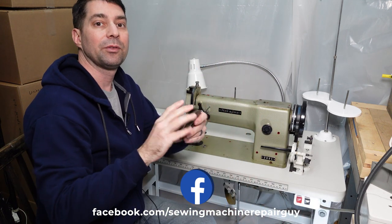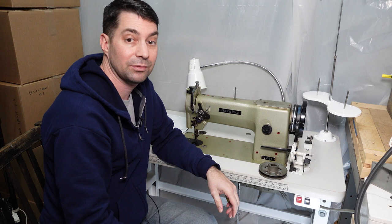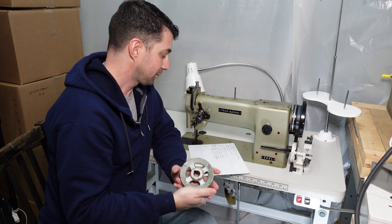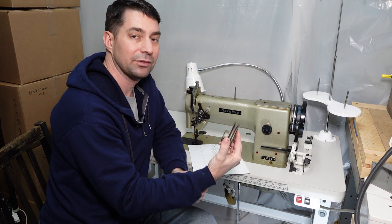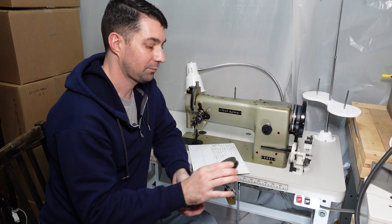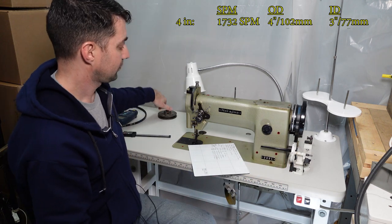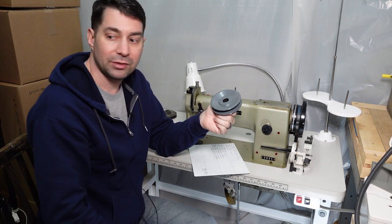Back to the first one — the original pulley that came with this machine, as far as I know. I was probably about 5 or 10 when my dad got it. Going by outer diameter gives rounder numbers — the inner diameter is odd numbers, but I'll throw it up on screen so you can see. The first one is a four-inch pulley and it got 1732 RPM or stitches per minute. One thing I want to mention: these pulleys are steel — very robust, very strong.